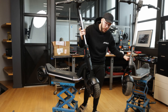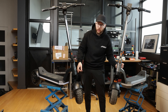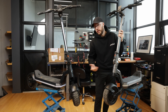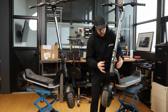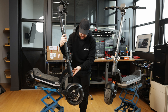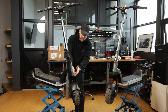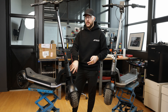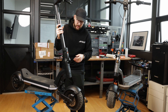Going up, we still have the same holes as on the V2 for mounting the steering dampener. This bracket is mounted in — it's not built in — so we have the holes to accommodate it. We refined the geometry of the direction stopper to work perfectly with the dampener, because on a lot of scooters the dampener is an afterthought and the handlebars lock left and right against the dampener itself. You want it to lock with the direction stopper built in. This direction stopper is rock-solid, built into the swing arm and the neck — it's one of the strongest parts of the whole scooter and it's stronger, cheaper, and better.